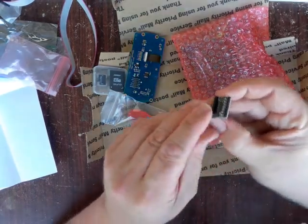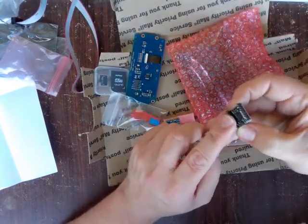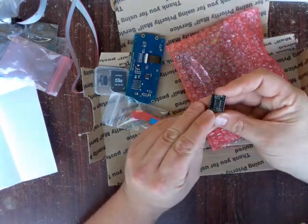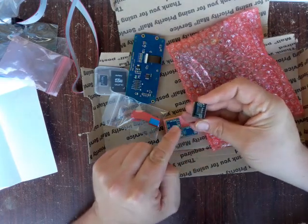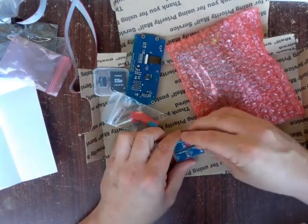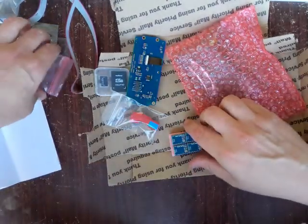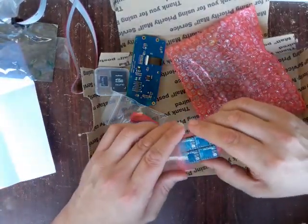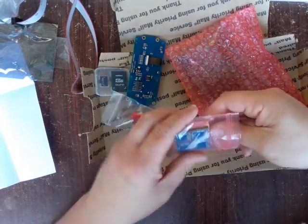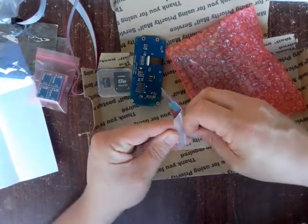These extra two pins — this is actually one of the main reasons I bought this board — allow you to set the current digitally. So you don't have to guess whether to turn it a little less or more. These two pins allow the board itself, through configuration settings, to control the exact current with a decimal number. For example, on a delta tower it makes sense to have all three X, Y, and Z towers running at exactly the same current, so you can adjust these a lot easier without any guesswork.